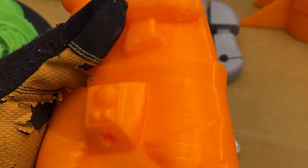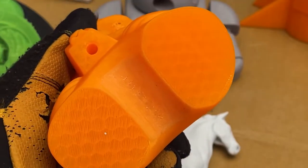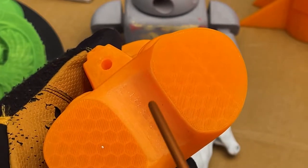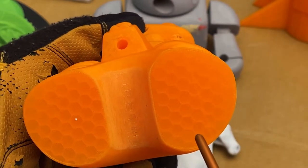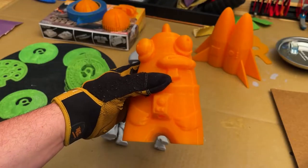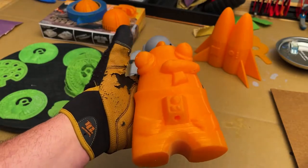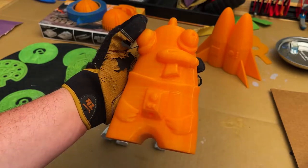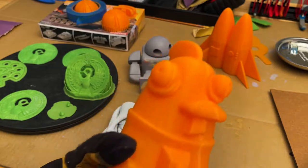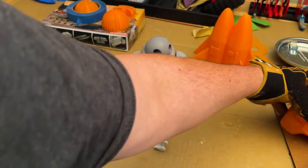This is an example of what you'll find in a raw print. If you look here between the feet, you can see there are some little rough spots — there was some bridging and weird strings between the two feet. Here you can see an example of 15% infill honeycomb, so that's what it looks like inside the whole figure. That's the support structure that keeps them together. This took about 22 hours to print at a 0.15 layer height. It did take a while, and as you can see, it just survived a drop onto a hard concrete floor. So maybe we'll set him down before we do any more damage.